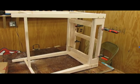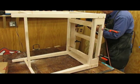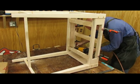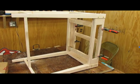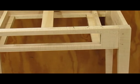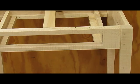I'm gluing and nailing the drawer runners to the inside of the frame. I used my flush cut saw to saw up the pegs and then pared off the additional material with a paring chisel, and then lightly sanded it to finish them off. So that much is done.